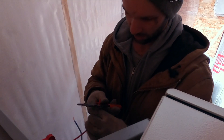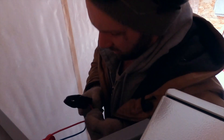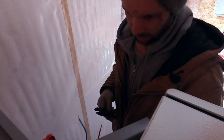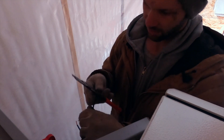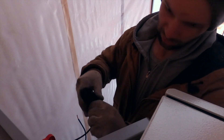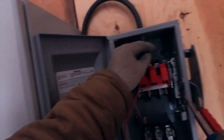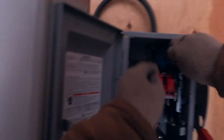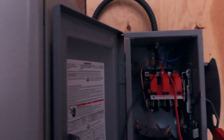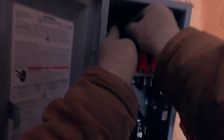It's getting dark out. I just need to wire up this side in the C-can so I don't have live wires not connected to anything. I'm going to wire it into the switch but not put any fuses in the switch yet. This stuff's pretty straightforward — it's a lot easier to work with than the old stuff. Pull test, and tuck that pigtail aside. I'd turn the light on for you but I don't have any power.